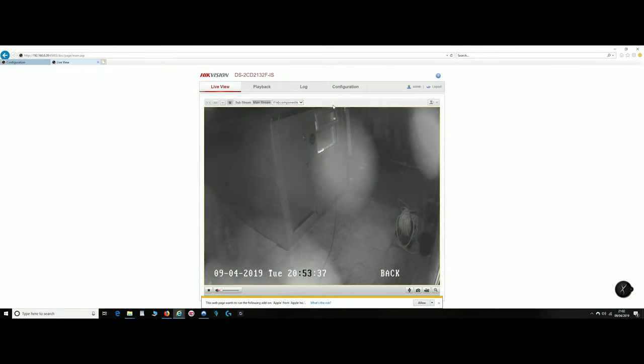as you can see. Loads of spots and blurs, and sometimes there's so many you can't see anything at all. The way around this is to either get different cameras, which I didn't want to do because I was really happy with these, like bullet cameras that don't have a dome around, so they don't tend to reflect that infrared light back so much, or use these sorts. Now, they call these a pig nose camera for obvious reasons.